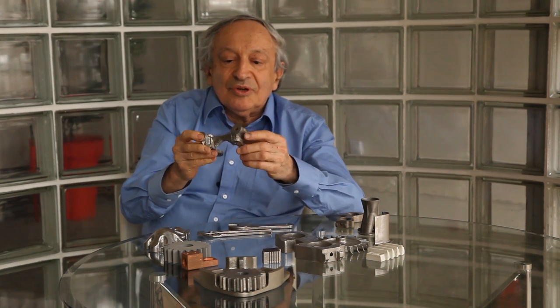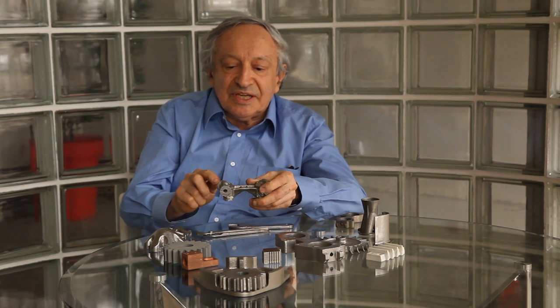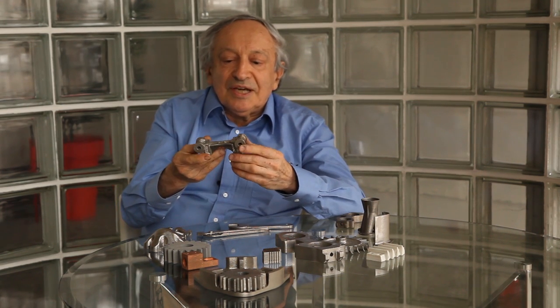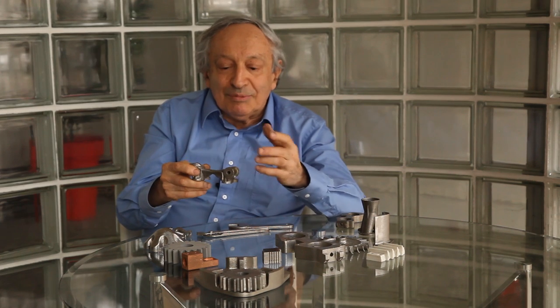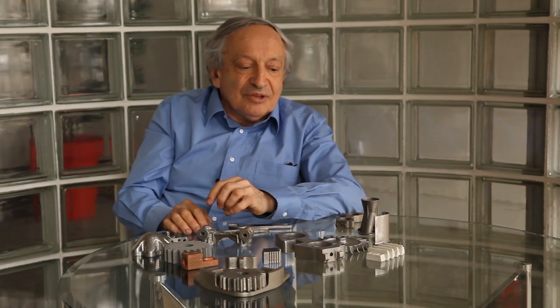The people who push metal 3D printing also push a design philosophy called organic design — basically a part where all the surfaces have a natural, free-flowing form. It sounds beautiful, but there's a bit of hype, because most metal 3D printed parts need some post-machining: you have to bore precision holes, and if threads have to be accurate, you have to tap it. If you have a truly organic, free-flowing form, you look at it and say, 'How do I clamp it?' — and even if you can clamp it, it will distort. So you have to think about the real cost of this part.